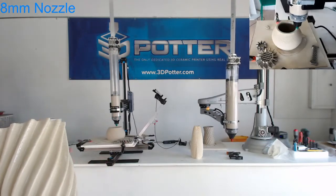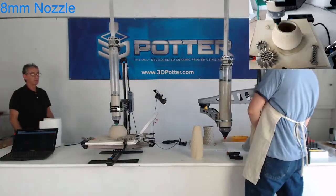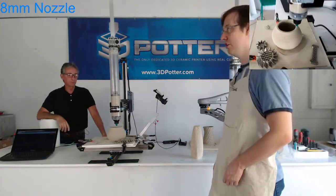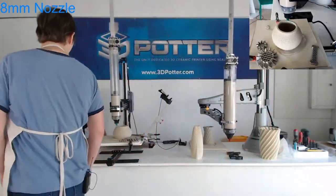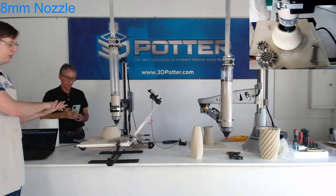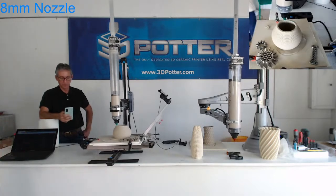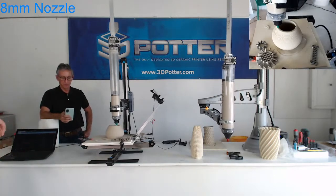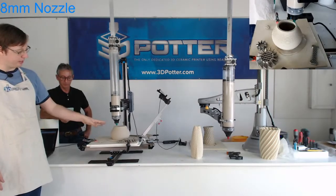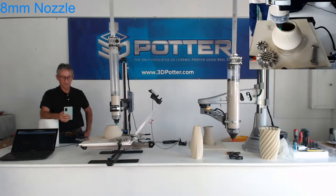And it is sort of a sweet spot, but the default settings we provide, the Simplify 3D and Cura slicing profiles, are really high on extrusion, which is good for interlayer cohesion. You could try and get it smaller to preserve clay or even do crazy fast prints, but our default settings have a very good adhesion factor, or mush factor.